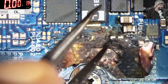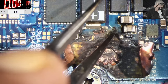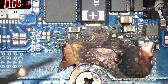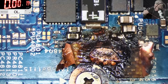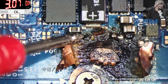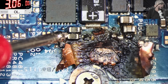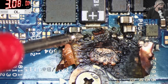Here we have a track which we don't know where it's going, and that's bad. That's really bad. This one we don't need. But it was not shorted, right? No, it's not shorted. This one is shorted. So let's come with some alcohol. Let's come with the power supply. It's taking three amps but I can't see anything. And here is 0.0304 — so here is a short. The capacitor, or here behind.